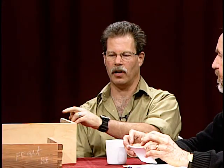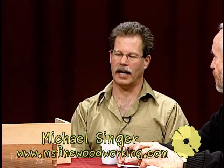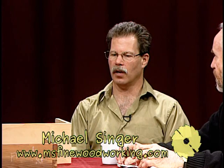So you said you'd veneer over a solid core. What core wood would you use if you're veneering, Mickey? Most cores are laminated, like apple ply here, or some people use MDF, depending on the application, because it's really flat and really stable. You can veneer over solid wood, but then you haven't really helped yourself as far as wood movement goes. You're getting a look, but you're not really getting the functional benefit of veneering, would you say?